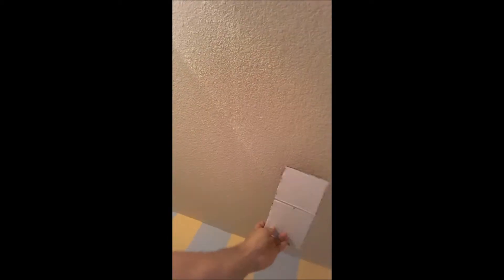I made a template the size of the opening for our new duct opening that's going to be right there. I put the template up against the ceiling downstairs, drew around it, found the dead center, and punched a nail through the dead center. Then I took it back down. Now you can see I have the nail left in there, which gives me a reference for dead center upstairs. So now I'm going upstairs and we're going to place this right over where the nail will be, with the hole as the dead center.